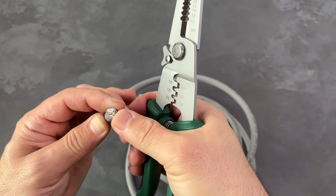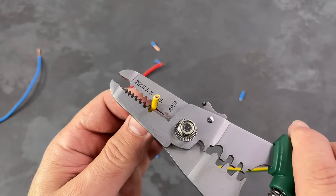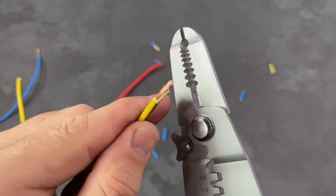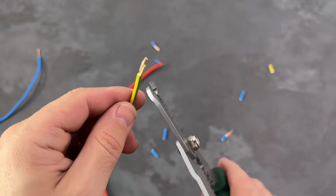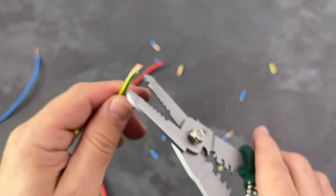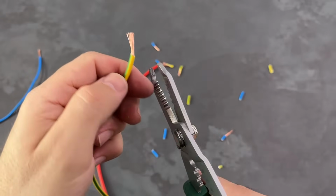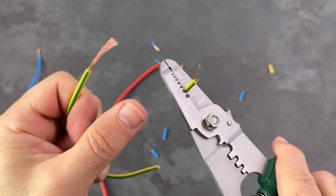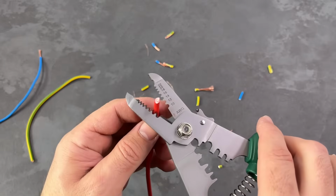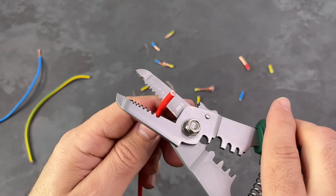It will cut them in a pinch, but it will not do a great job. It has the same issues as the scissor model when it comes to wire stripping. Too many slots with weird sizes that either pull copper strands or don't cut the insulation enough. This is the worst result yet. Again, it does a better job on the 4 square millimeters wire it was not designed for.